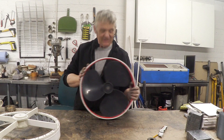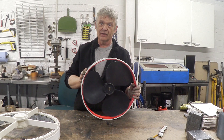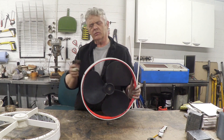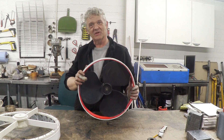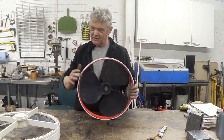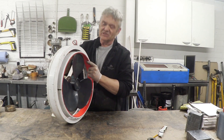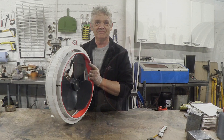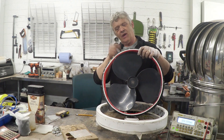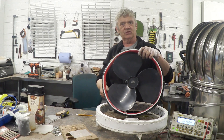That's been heat welded on, and all I've got to do now is put my magnets on. I'm going to do a north-south north-south pattern — anybody wants to do anything else, knock yourself out. This just fits on there like that, and with the magnets in it's ready to go. The rotor is done — I've got 50 magnets around it, just glued on with some hot glue.